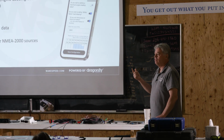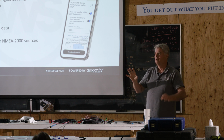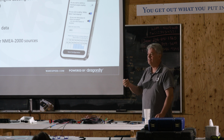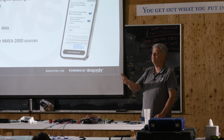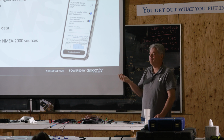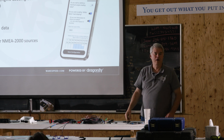We had one installer that would always sell a second regulator and install 2 regulators. And I've gone around and around with him because his statement was that redundancy is reliability. Well, lightning strike's going to be your most likely issue. You're going to take both of them out. Have your spare in the box.